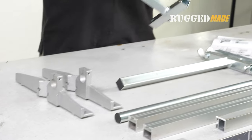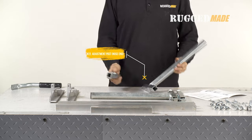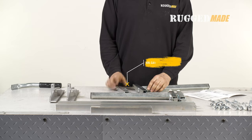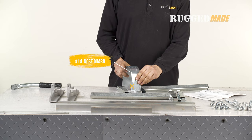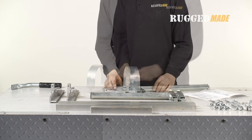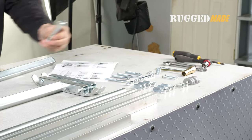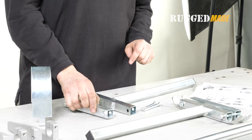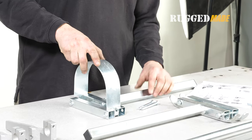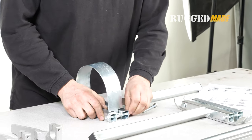In step two, take the remaining adjustment post, item 22, and attach it to the other clamping bracket, item 20. This will be the nose end of the chainsaw bar, so the nose guard should be installed between the two plates. The bar clamping plates should face each other. Use the remaining two M8 by 75 bolts here. The bottom of the clamping bracket has nuts welded in place. The bolts can be hand-tight for now.